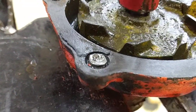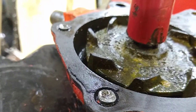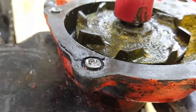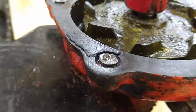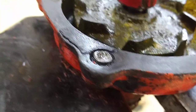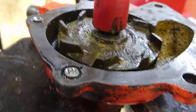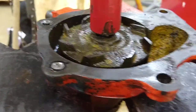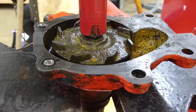I still have those two screws I'm dealing with — the ones I had to drill the heads off to get the backplate — but they've been soaking in the Evapo-Rust too. I've got some stripped bolt removers, and I'm going to hit them with a torch, put PB Blast in there, and try to loosen those up.